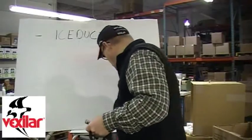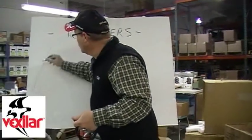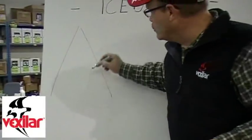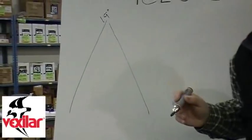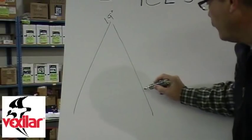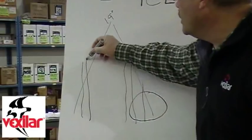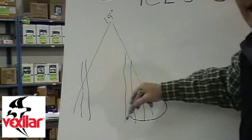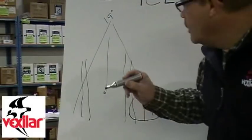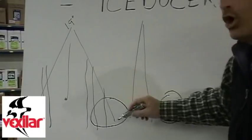Let me explain how the 19-degree works. When the transducer kicks out a signal at a wide degree, most people think of a cone view — a 19-degree cone. But the true fact is all transducers have different degrees of cones, and it's not always a cone shape. If there's a boulder sitting here, or stalks of weeds in this area or that area, the 19-degree cone will pick it all up. You'll see lots of objects that make it very difficult to see a small jig on your line. By using a narrower beam transducer, you cut out that big rock that causes the shadow.